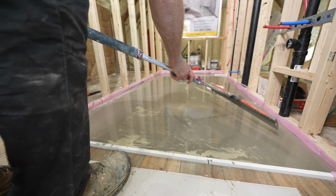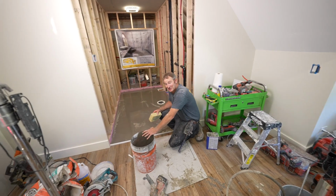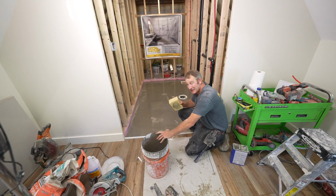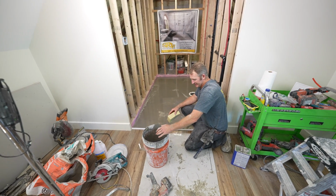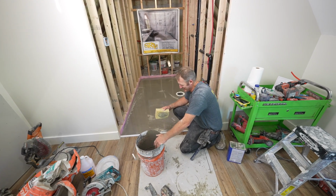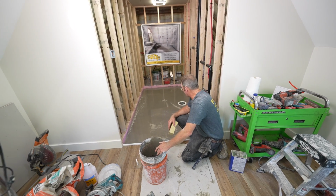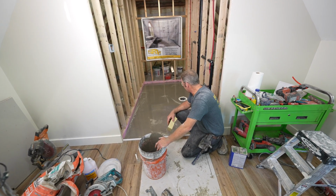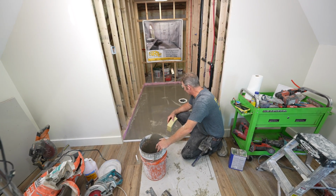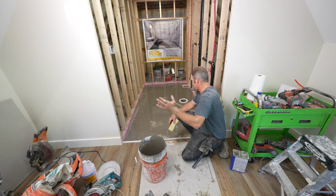Okay, that should work. So that was a 5x9 bathroom. I used about 3.5 bags. Now, when you do mix a partial bag, I would definitely just recommend mixing the whole thing and just throwing out the rest that you don't need. So, 1/2 inch out of level in a 5-foot by 9-foot bathroom, you're gonna need about 4 bags of self-leveler, but it's definitely worth the expense.